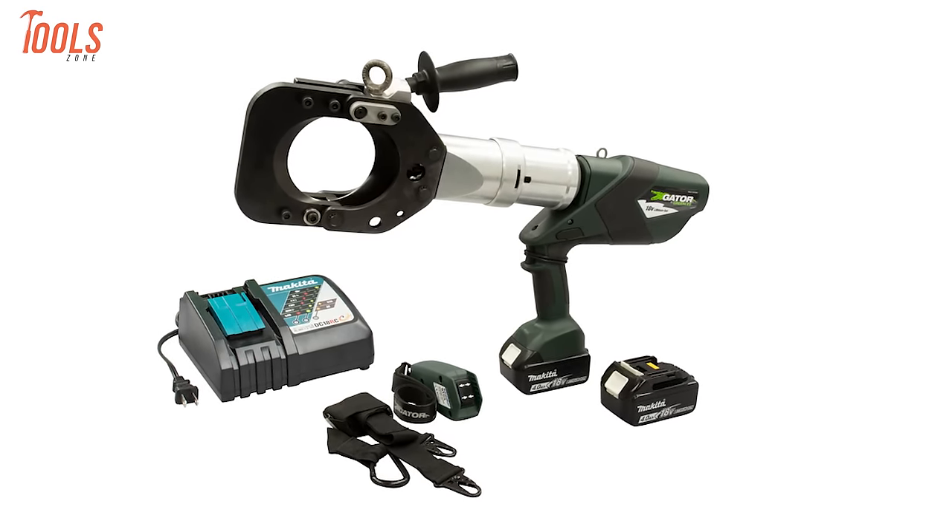The SafePull RLT from iTool Co., a running line tensioner, digitally tracks and logs pull loads up to 20,000 pounds for total peace of mind. Paired with an ingenious mobile app, electricians can monitor real-time tensions visually and audibly to prevent conductor damage or breakage even in long underground routes. Configurable alarms provide alerts if operator-set limits are exceeded. The RLT also utilizes GPS to pinpoint pull locations and log results attributed to specific projects. The compact tensioner's lightweight design and included carrying case maximize portability for use across work sites.